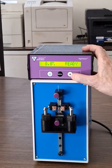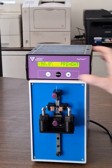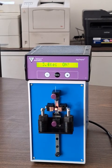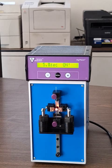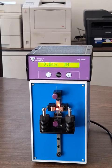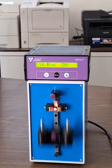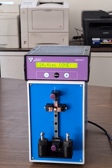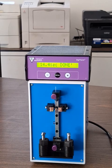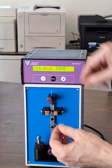I'm going to pull the needle by using the plus button to actuate the whole pull. It does the preheat for two seconds, then it's at 37% heating cycle, and it's counting how long it's taking to pull the needle, which is a good diagnostic if it changes. That will affect the shape of the needle. When it finishes — this took under 15 seconds — you can just loosen these and take out the bottom needle.